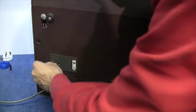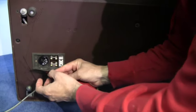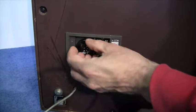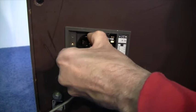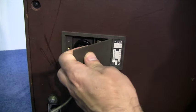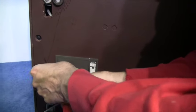There's the voltage selector over here. Just unscrew that - that's got the fuses in. This is what you would pull out and push back in again. That'll have little pins on it, and that'll set different windings on the transformer. So you can use it practically anywhere in the world.